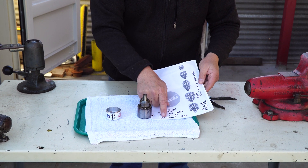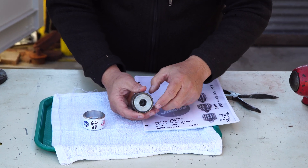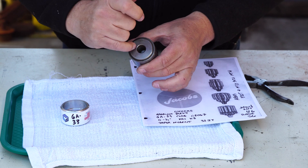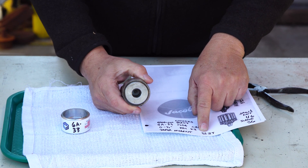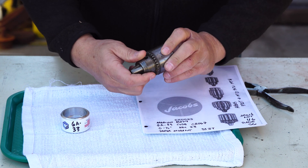The key is a K3. It's a taper mount and the back — this part — is tapered and it fits on what's called a tapered arbor. It fits in your machine and that taper is a very specific one: it's a 33 Jacobs taper. That's the name of the taper and that's hence the name of the chuck — 6A33.